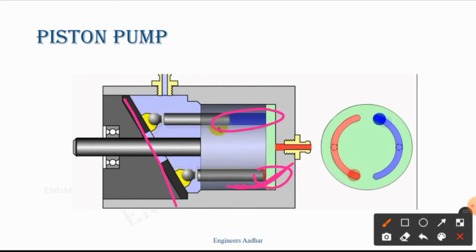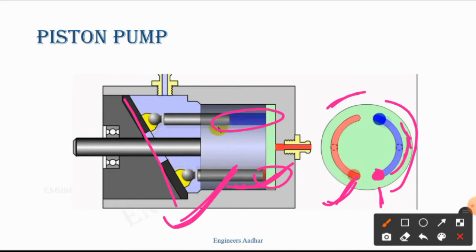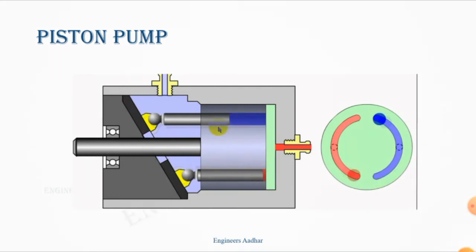It will become completely liquid from this side. The front view is the same. Now we are looking at it from the side. The first piston is here — the volume is here. The inlet side is here, the fluid is in that piston and the cylindrical block cavity. After half rotation, the piston reaches the discharge side.